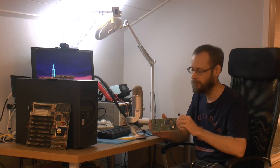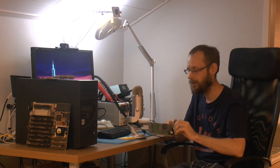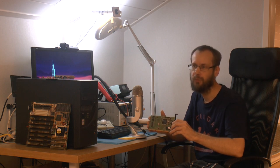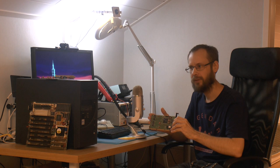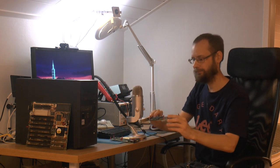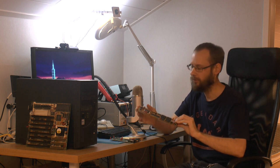So in this video, we compared VESA 2.0 in Duke Nukem 3D with the screen buffered mode. And I was initially wrong. I assumed somehow that I was using VESA 1.0, or 1.1 or 1.2. My card should support 1.2. But I think the lowest resolution is actually 640 by 480, and you can select that with a 1.2 BIOS like I have on, say, this card. So we weren't actually running that. We were running basically a screen buffer mode, not a VESA mode.